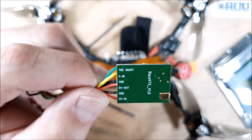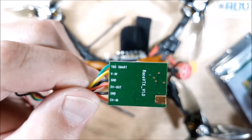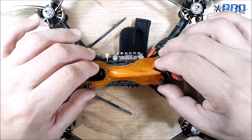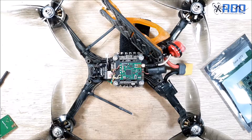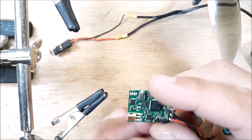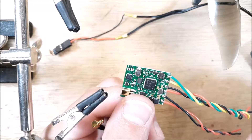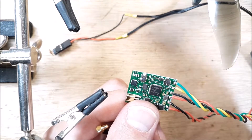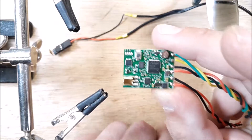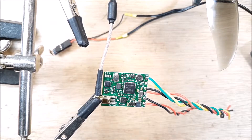So in this case I'm going to unsolder those two camera power wires and I have the TBS smart audio line running to my flight controller. I'm going to replace this VTX and go through a couple little things. Before tearing the old one out, I'm going to check continuity on the new one to make sure there are no shorts, and then I'm going to power it up to make sure it doesn't release the magic smoke. I cannot urge enough — before you power up a VTX, make sure you have an antenna connected to it.